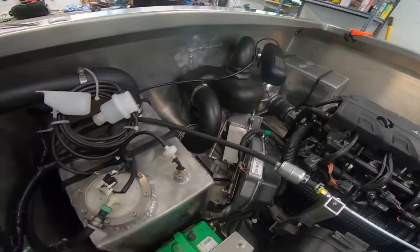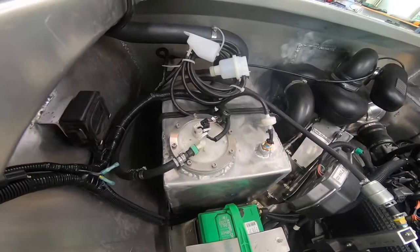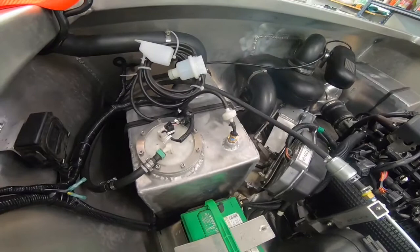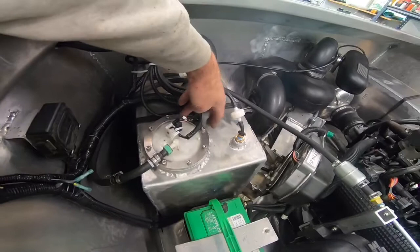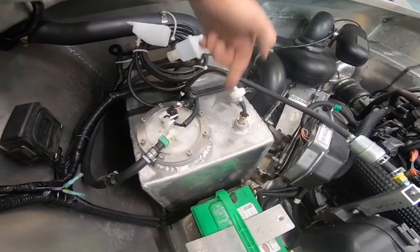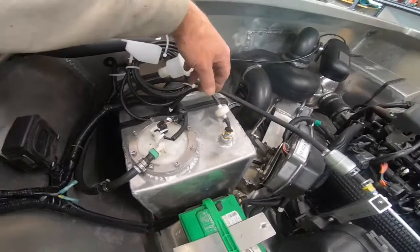I'm gonna add a little more gas to this tank — I'm pretty sure it's pretty full. The gauge on the dash, I'm not sure how sensitive it is. I put a few gallons in at the station before I went out — knew there was already a few gallons in there. It showed completely full but in short order dropped a couple notches on the fuel gauge. It's possible the float might be hanging up, or it's just a different height than the jet ski's sensor. I could pull this out and bend the wire the float is hanging on — it's kind of a right angle down there.